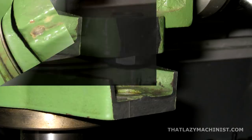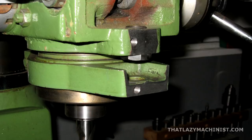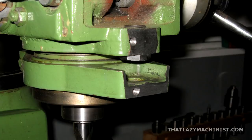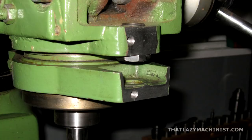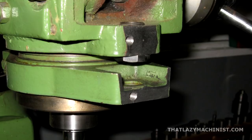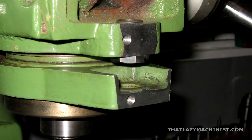Now we can prick punch and center punch our hole locations in the Z-axis. Their position height-wise is not crucial — anywhere will do, just don't get close to an edge. Remember this is gray cast iron. Then, using a guide block — any piece of mild steel that is good and square with a hole drilled through it the same size as the hole you want to produce — hold the block up to the part to ensure you're penetrating perpendicular to the surface. Drill the two holes, then using a tap block to guide your tap, tap the holes. I'm using a 1/4-20 tap here. Note that the holes are offset to the left side of the casting to avoid the depth stop bore.